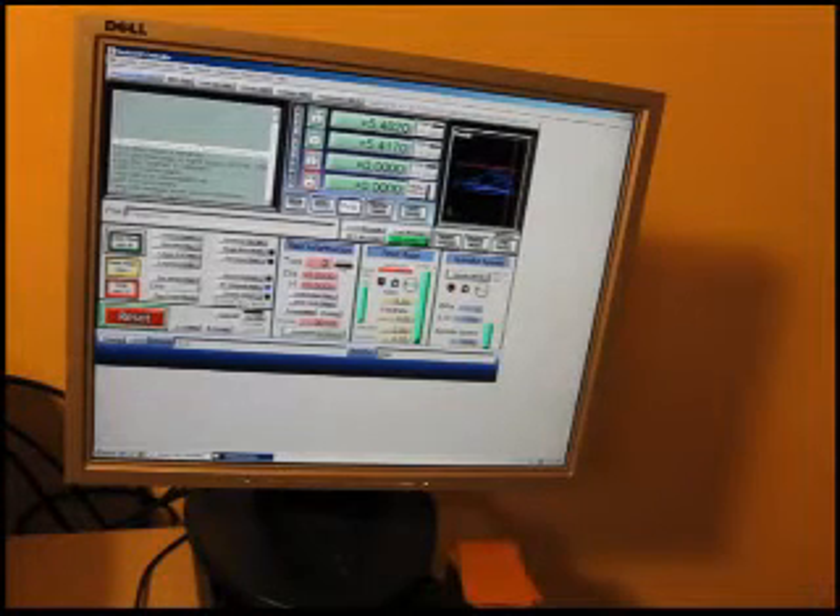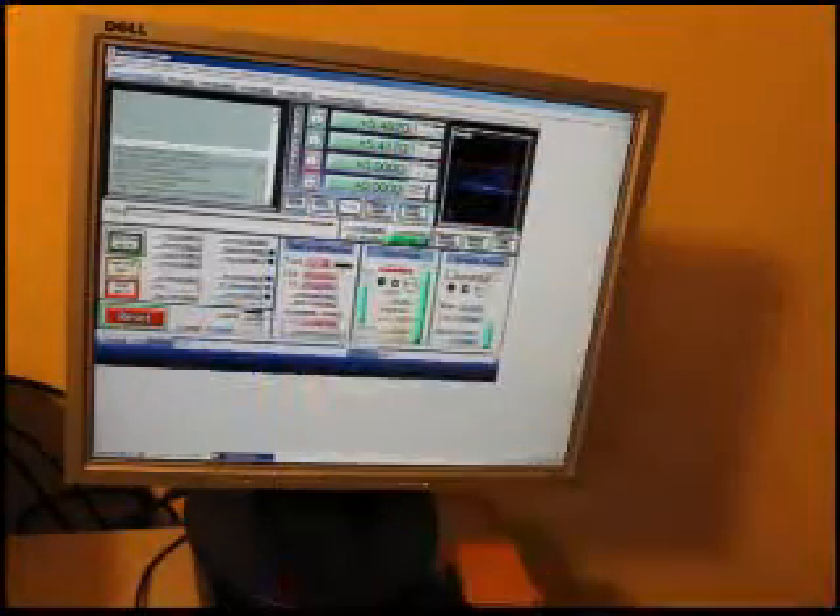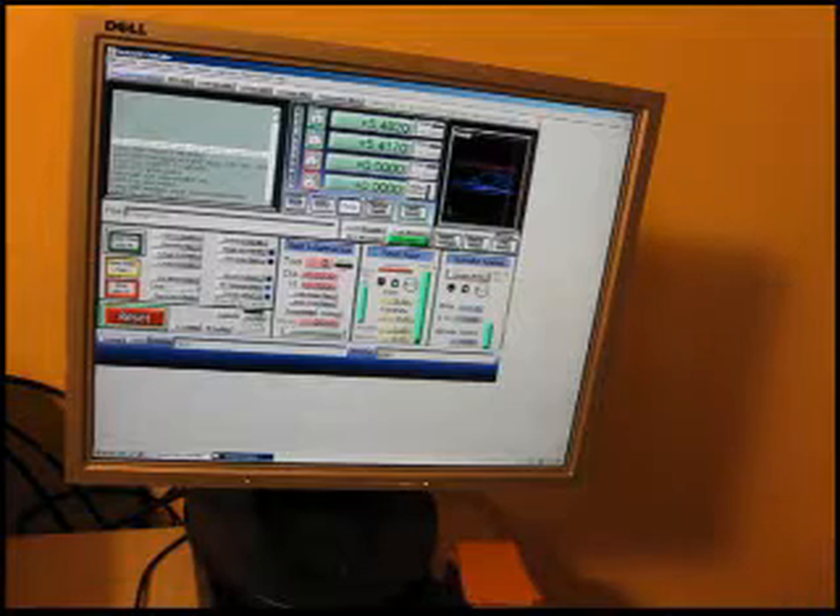This Full Spectrum Engineering laser cutter has adjustable speeds so we can cut each layer at different speeds. The engraving layer is going to be cut faster, and we can also control the laser power with PWM laser power control, so we're going to use less power so that we don't cut through the material. Today we're going to cut quarter inch poplar wood, so it's pretty thick. Let's move over to the laser cutter.